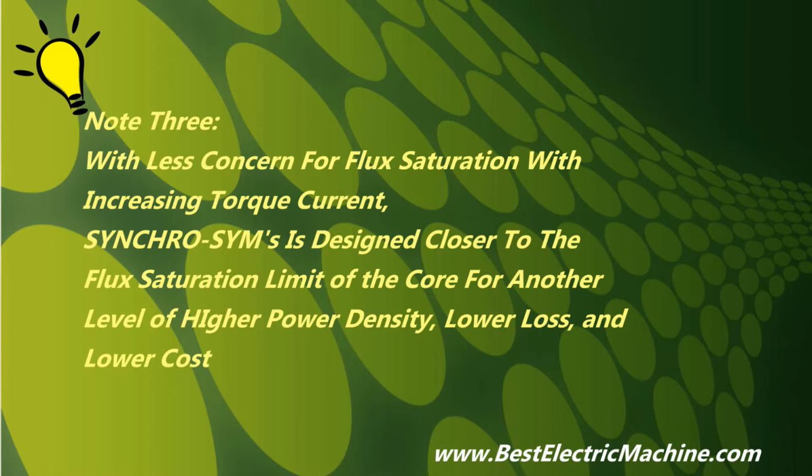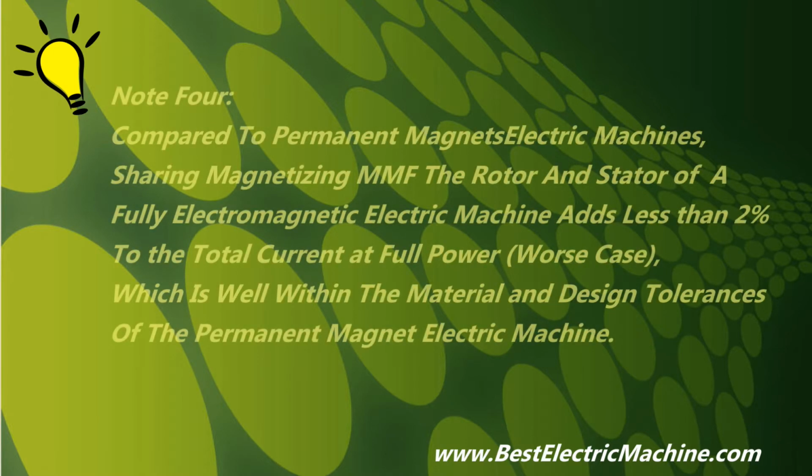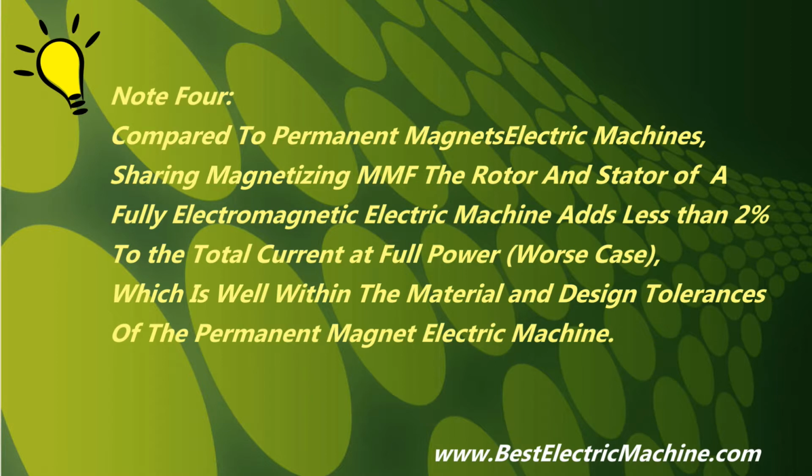For all other electric machines, with flux magnitude as the orthogonal vector sum of torque MMF and magnetizing MMF, the steady-state core flux density design must compensate for increasing flux magnitude leading to core saturation with increasing torque. Note 4. Shared between the rotor and stator active winding sets, magnetizing MMF of the new electric motor adds less than 2% to the total MMF magnitude at full power, worst case, if compared to the permanent magnet electric machine electromagnetic core, which is well within just the windage and material tolerance range between any electric machine design.